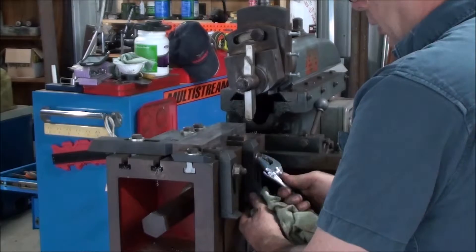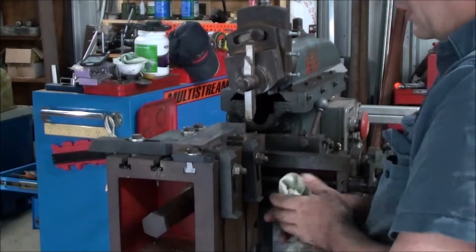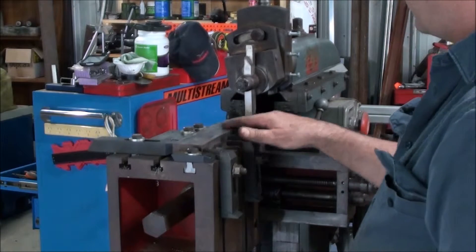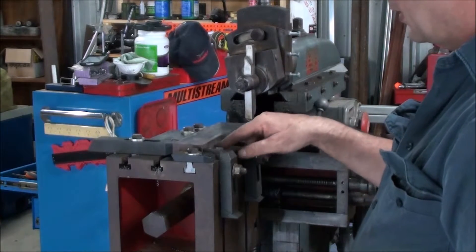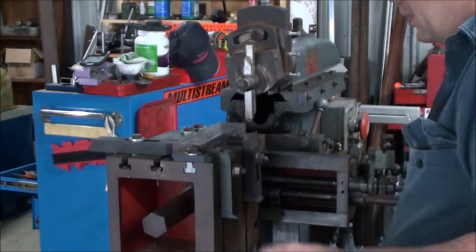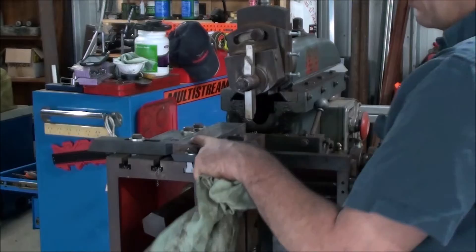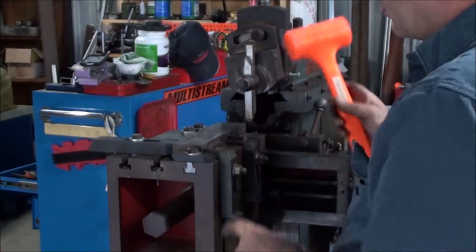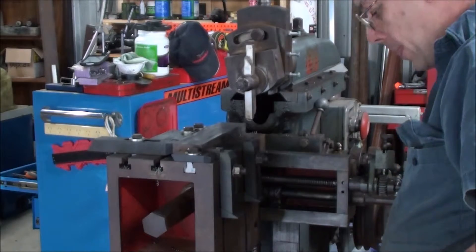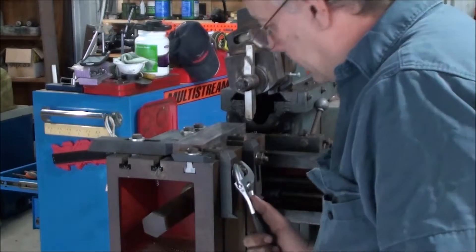So what I've done is I've taken this off, turned it over, deburred it, turned it over, chamfered — filed a chamfer on there — had to deburred it because it was pretty rough. Make sure you don't hit the finger when you do that; you'll only do it once, you won't make a mistake twice. Make sure that it's been deburred.